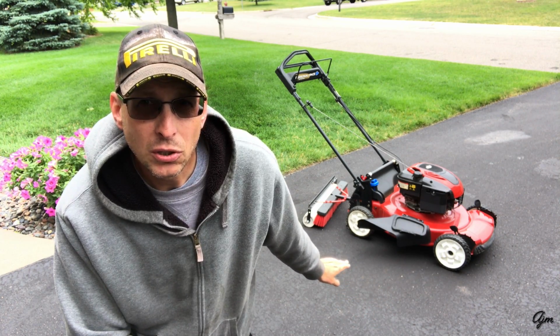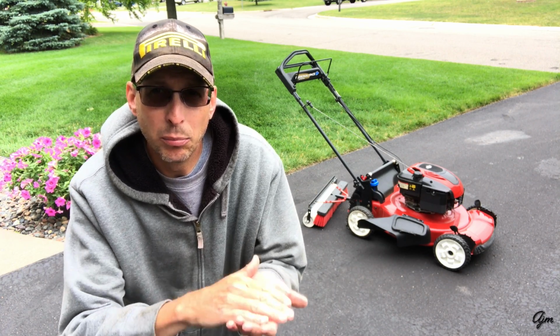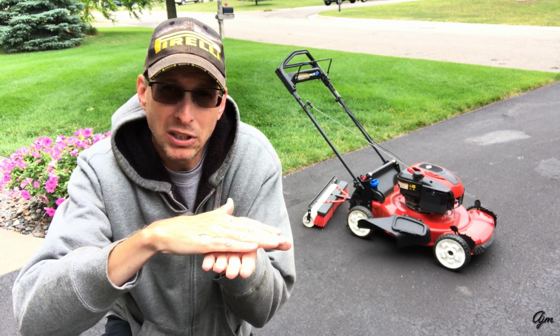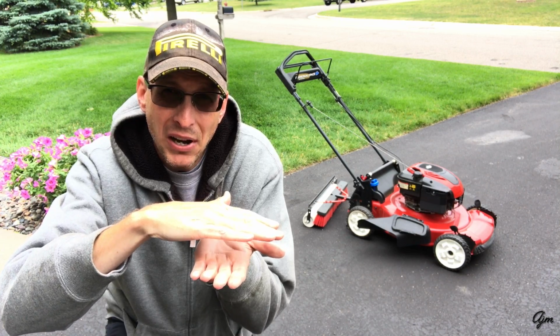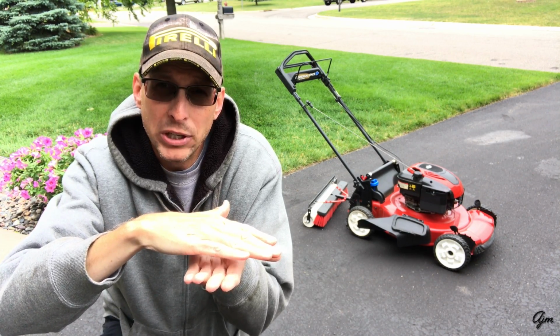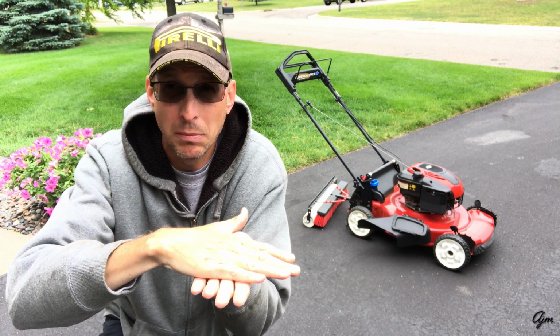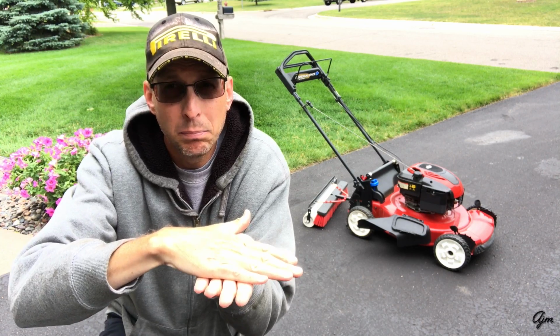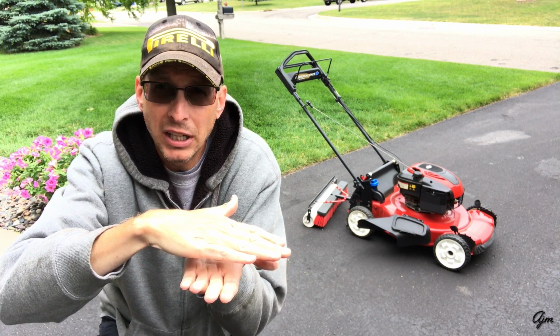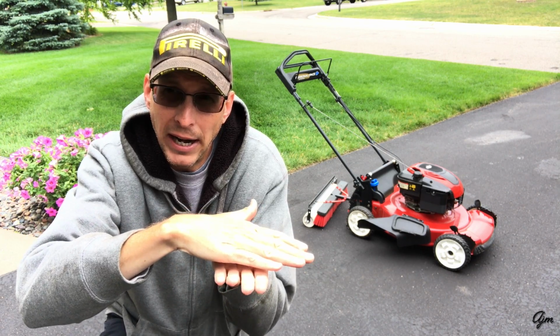The other thing is, you'll see when it's hooked to the mower, I've actually mounted the broom head so it rides about 1/2 inch off of the ground. Originally I had the bottom of the broom at the same level as the bottom of the roller, and that pushed really hard in the lawn, but lifting it up that 1/2 inch actually allowed it to kind of glide across the top of the grass.